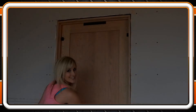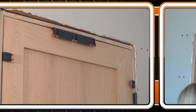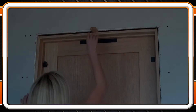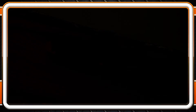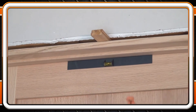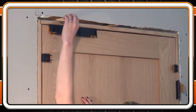Now carefully pull the door shut. This is where the beveled cut of the parts will help guide the door into the frame. With the door shut, shim above part T until the shim feels snug and then fasten. As long as you are shimming at the part location, the parts will prevent you from over shimming. Thanks to the low friction material that our parts are made from, you can simply slide them around and shim as much as you need.